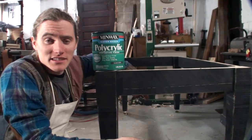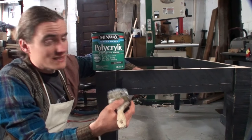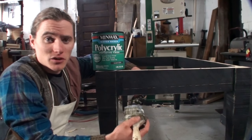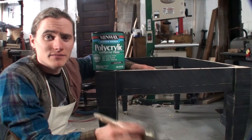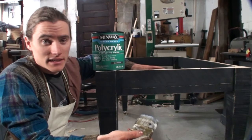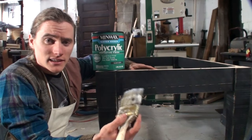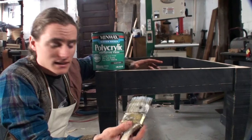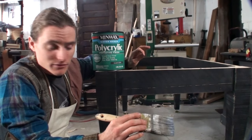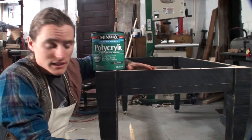The final step in this process is just as easy as all the rest and that's applying the clear coat. For my table bases and the tops I use Minwax polycrylic in satin. I buy it at Home Depot and it's around $50 a gallon. It's not the cheapest finish but I like it for its quick dry time and the fact that it's water based. On the bases I only apply one coat of finish, unlike the top where I apply two or three, to avoid a thick looking finish. So there really is nothing to this step — just give it one coat and let it dry.